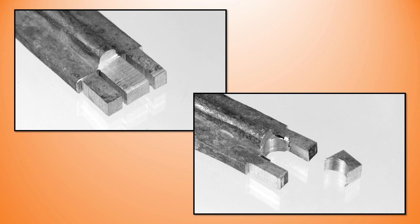The way I'm dealing with getting two tenons is I cut down with a hacksaw and then cut in, get rid of that piece of material, cut down, cut in, get rid of that, and then I cut down twice here. Why twice? Because that allows me room when I make this drill movement here, that if I am a little close to the edge, even if I blow out the side with the drill, it's not going to ding my tenon material. If I'm a little tight, if I don't have space in here, then if I blow out, I can sometimes carve into the tenon material, and that's going to make me cry.